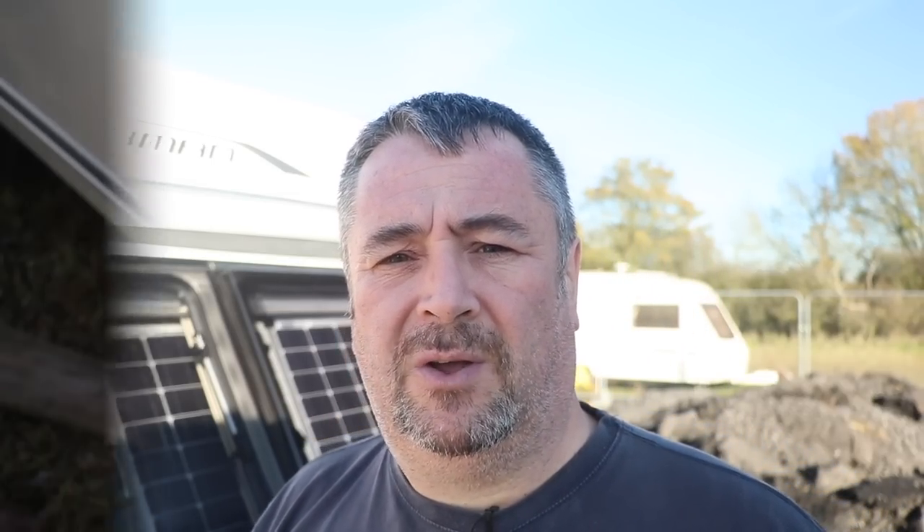Behind the window it won't operate at a full 100 watts — the windows are tinted and the panel itself is somewhat obscured, so it's behaving more like a 40 to 50 watt panel in its current configuration. However, that's more than enough power to trickle charge our battery. It also helps that our caravan faces due south, so even on the coldest shortest days we still get quite a large track of sunlight throughout the day. If you're interested in this particular panel, there's a link in the description — they're around £130.